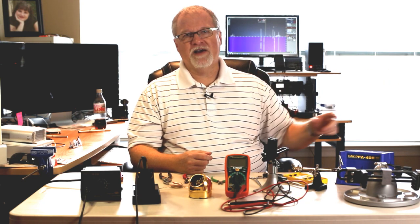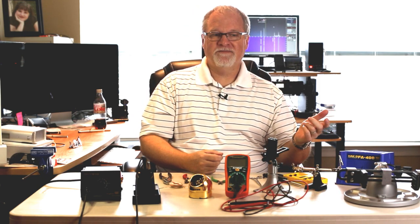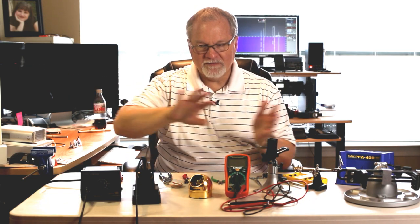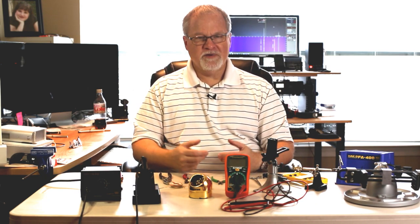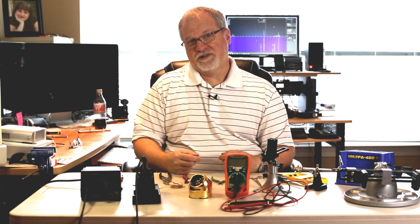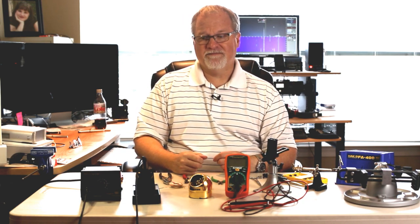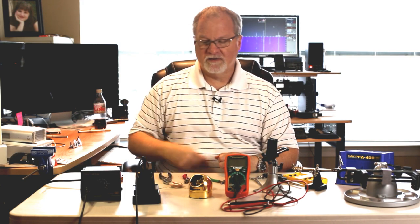What I do instead — you can't see it, but off camera I've got a floor fan sitting on a base. I turn that on to the lowest setting and just have it blow air across the desk. As I'm soldering, the fumes are being blown away from me, but it's not blowing so hard that it blows things off the desk. I'm in a pretty good-sized room, and by just blowing the fumes away from me it dilutes it enough where it's not a problem. If I was going to be sitting here eight hours a day soldering, I'd want something more serious, like a fume extractor that vents outside. But just opening a window and having a fan blowing across your desk is enough. You definitely need to do something, because you don't want to breathe the fumes of this stuff directly — it's not good.